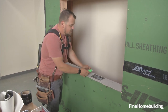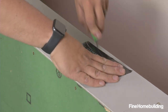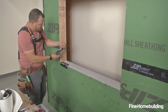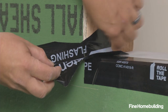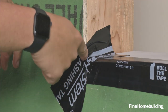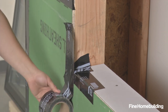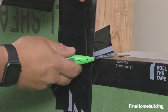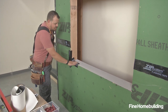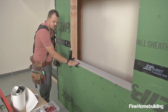So there's our first step — we're going to flash the pan. Second, we're going to cut a V or triangle out of both sides of this six-inch piece and then apply it so that when we turn the corner, we're getting rid of a lot of that material. After putting the last vertical piece on, we've taken care of what would have been a pinhole gap and we're now able to go vertically. Now that we have these three pieces of tape in place, we're managing the water at our edge. We'll take one more run of tape in the back to protect the sill as far back as we can, then the whole system will get rolled into place.